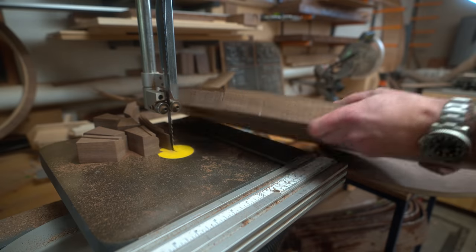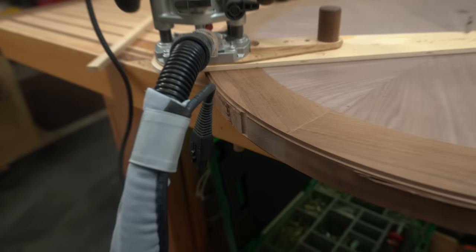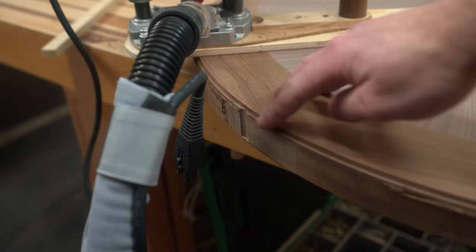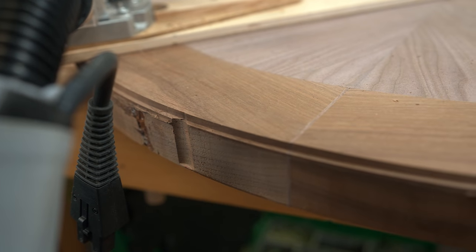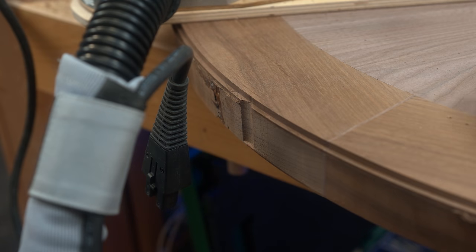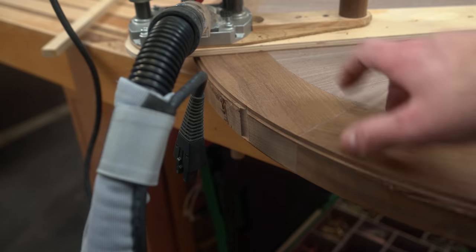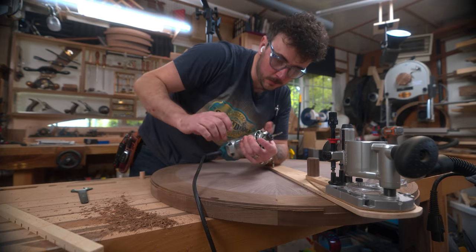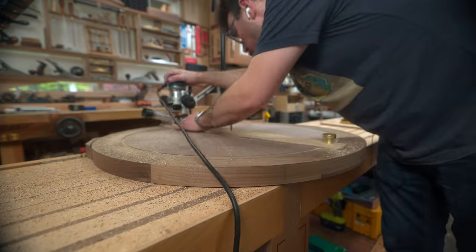That bit got into the edge just a little bit, and I had some tear out, and I'm just really not stoked on how that flushing is going. So I took the bit and hit where the deepest part of this little divot is, and I'm just taking that out of the radius, and I'm just gonna go all the way down with this bit. I think it'll be a lot cleaner in the long run. You can always count on routers to mess something up. Stupid routers. Man, I got some white boy Jufro going on today.